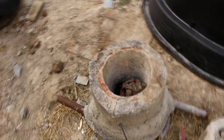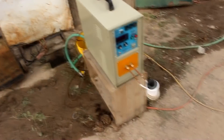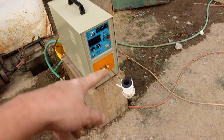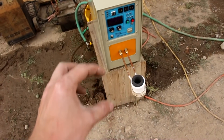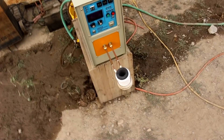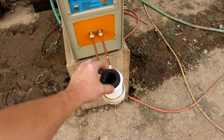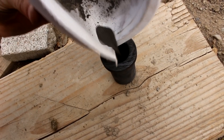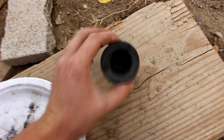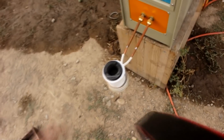I never could get my homemade furnace working. I may come back to this, but for now I've got an induction furnace to play with. This thing has a very high frequency magnetic field switching, which is very powerful. That causes eddy currents in the metal — it's basically like a short circuit in a transformer. That'll cause it to heat up and ought to melt steel. So let's put our stuff right in here. Looks like just about right for this size crucible. Let's get the big generator going and heat that up.